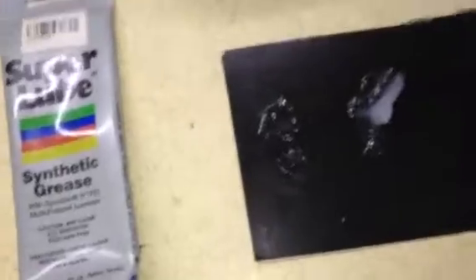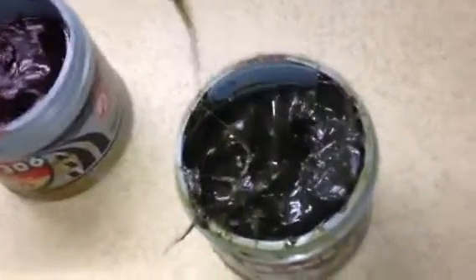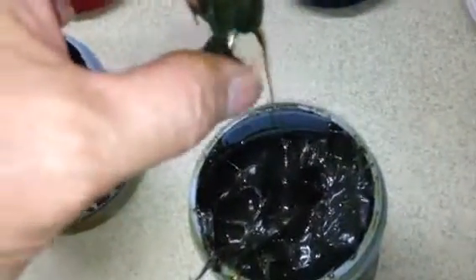There are O-rings in the pivot bushing, so this Super Lube will probably last a lifetime. I use Super Lube synthetic in my steering bushing, but I like this chassis grease. Look at it — it's in strands. My bigger concern using a grease would be in the steering assembly in that bushing where it could work its way out. If you've done your steering bushing, as Corey said, I pulled the bottom part out and greased it up using my Super Lube. Next time I'll use the chassis grease because look at it — it can't work its way out. It's waterproof and it obviously lubricates, and I like the stickiness factor to it.